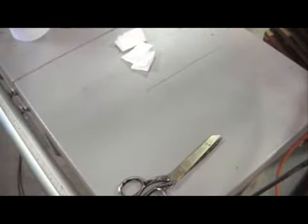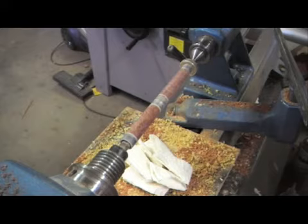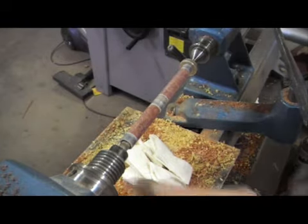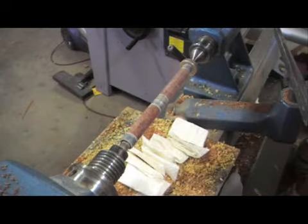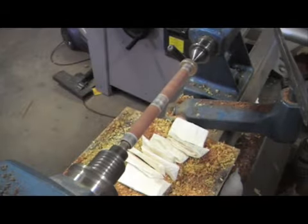I'll grab this and put it on the lathe. Back on the lathe, when you're applying CA it's important to just turn down your lathe. I'm fortunate I've got an electronic variable speed lathe. I've got my ten sandpapers and my ten paper towels there. It's very important to turn it down to about 800 revs per minute.